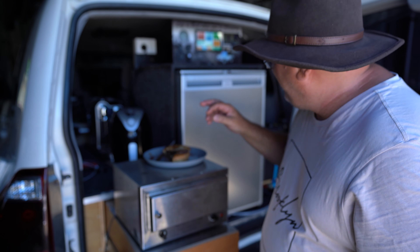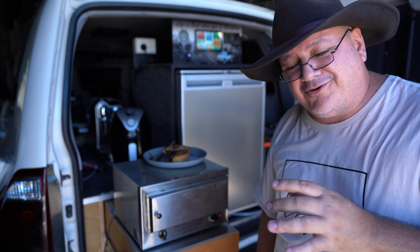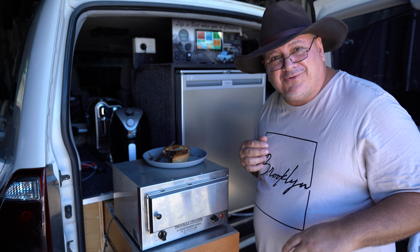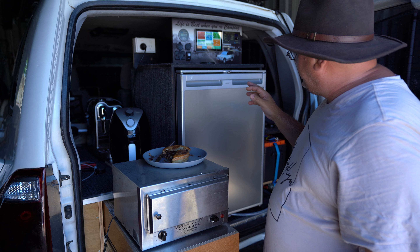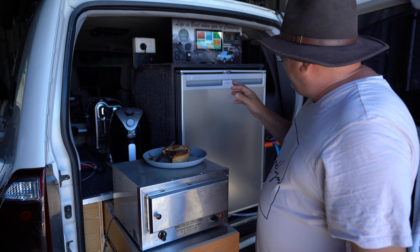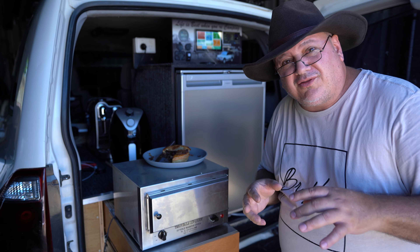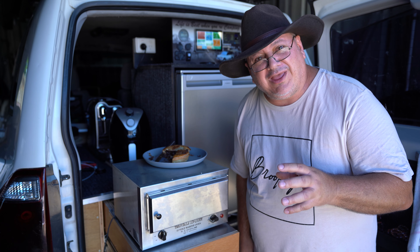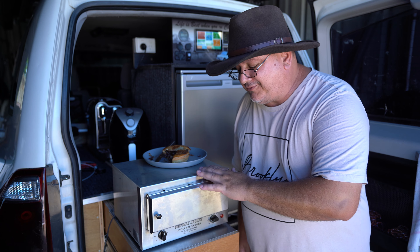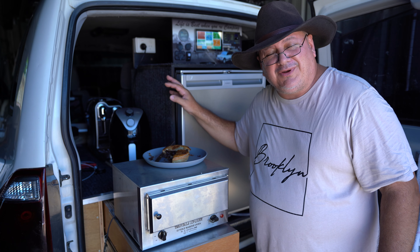So that's another good success. Battery is down 25% and I cooked the meat pie in the air fryer. Just working out the power consumption — it looks like we've gone through about 26-27 amps total, so about 23-24 amps consumed from my Kick-Ass AGM battery. It seemed about 26 amps came out of this one, and it probably would have been the same if I didn't have to turn it back on and let it preheat again — so essentially the same result as yesterday.